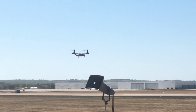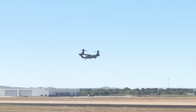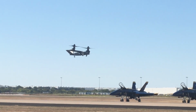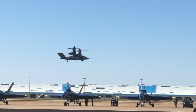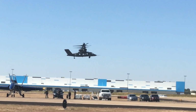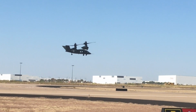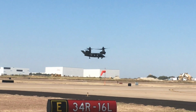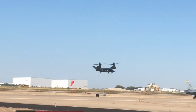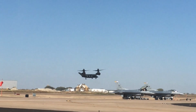Completely fly-by-wire, the V-280 flight control software translates pilot command into movement of the control surfaces and the rotor blades, ensuring redundancy in the electrical and hydraulic systems. The hover flight control provides excellent precision hover capability. The V-280 is capable of 45 knots sideways flight, with excellent controllability.